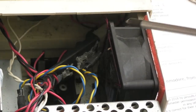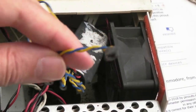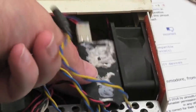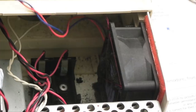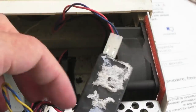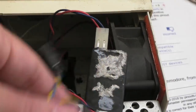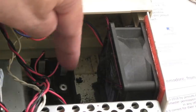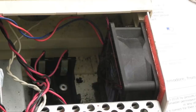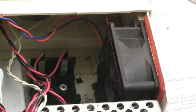Looking in the fan area — the fan should have a filter on top but it's just crumbled. There's also a floating pin header and something else — some sort of battery module or fan controller, it's weird how it's got sticky tape and a thing around it. Is that a mod? The battery bay here probably needs replacing or at least cleaning up because the contacts look a bit corroded. This is primarily why in the previous video we were getting problems — if you left it switched off for a few hours it would behave strangely, sometimes going straight to the supervisor prompt.